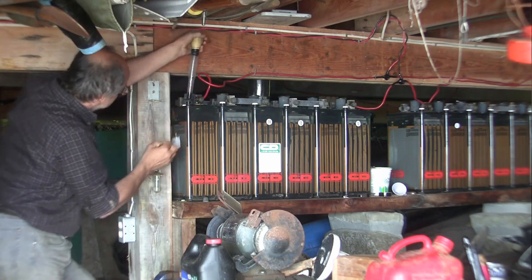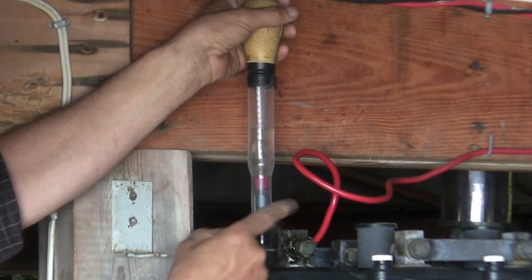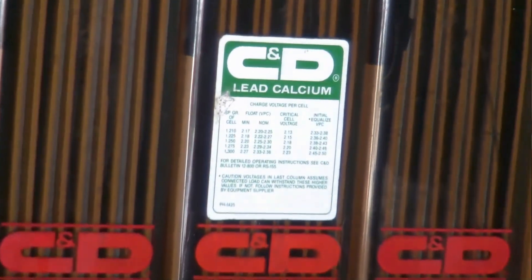There are a lot of people out there who claim to be able to rejuvenate batteries, and I did some googling and came across EDTA. EDTA stands for ethylenediamine tetra-acetic acid, commonly used as a food additive, and once dissolved in solution seems to work well releasing hardened deposits from the plates. It worked for me and the EDTA continues to protect. One of the things I check regularly is the specific gravity of the battery acid. On the side of these batteries is a table describing preferred specific gravity values — values I never seem to be able to reach. So instead I take a relative measure as an indication of the charge level. A higher reading is good and lower not so good, and in any event I try not to obsess about the actual number.